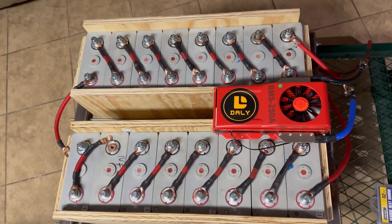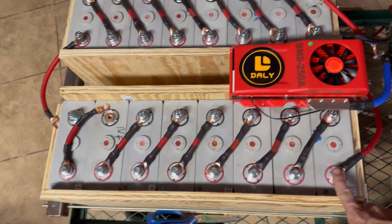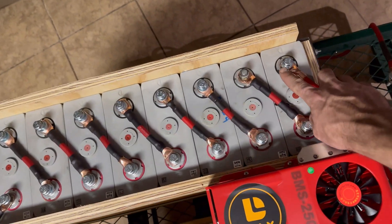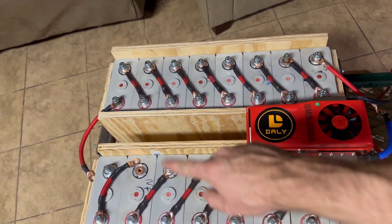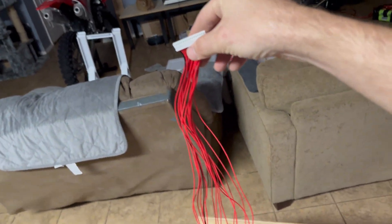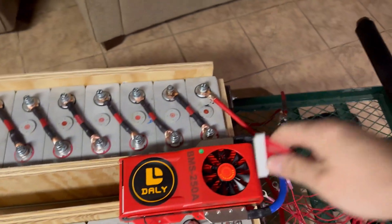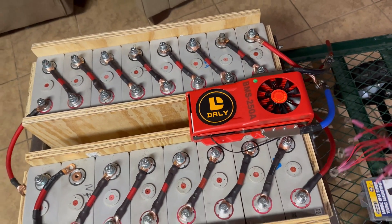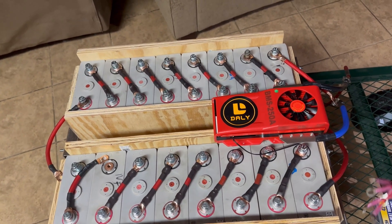We're just about ready to connect the BMS. Like I said before, this is a 16s battery for a 48-volt nominal voltage. This is our main positive, and to connect these in series you literally go positive, negative, positive, negative, all the way down. It goes across all the way to our negative here — even though this wire is red, I promise you this is our negative. That's all in series. The battery will have 48 volts — be careful, because all these are live, so don't be setting tools down on this and making a short circuit. I went ahead and made the balance harness. I did change the BMS because I forgot I had this big 250-amp unit kicking around, so we went and slapped that on. I don't plan on pulling that many amps out of this battery, but I had it so we're going to use it. It's also a smart BMS with a Bluetooth dongle — I can plug it into my computer and all that good stuff.